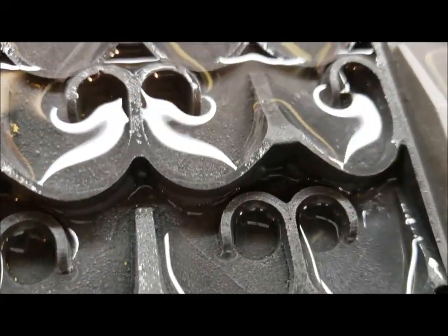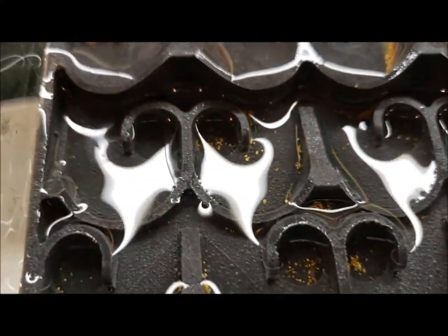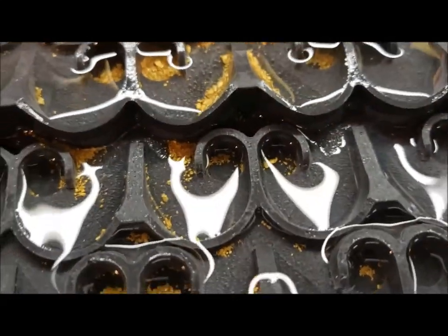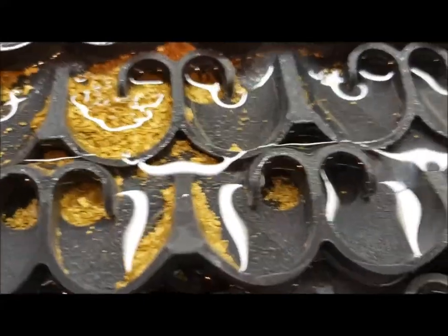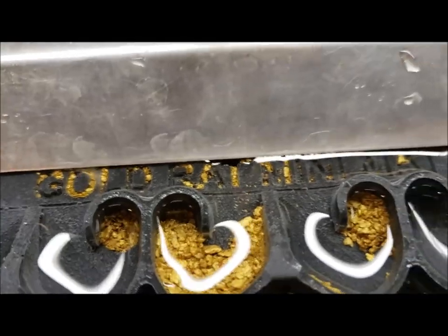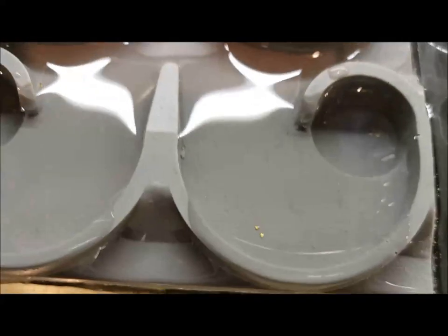So physics kind of let us know how this heavy material is moving through here. A lot of people want to argue, well, there isn't regular material in there, so it really isn't a good test. You know, a test is a test. We're going to run some pay dirt through all these systems in the spring, and we're going to do the same thing. We're going to take a look at what she lost and what she kept. We'll do the test with dirt in it, and there should be a direct correlation in the capture rate. So that's what's going on in there, the bottom of the regular Dream mat.